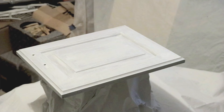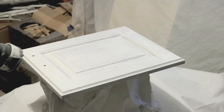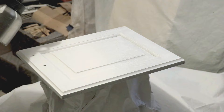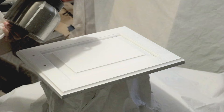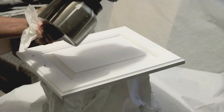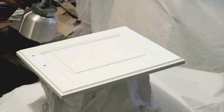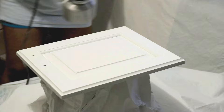Now I'm going to show you how to do it using an actual spray gun. I am using the Titan spray gun, but any spray gun will probably provide the same result. Make sure you are not so close that you put too much product on top of your door — this will allow it to have a factory-like finish. I prefer to have my doors sprayed with a spray gun because there were a lot of streaks in the primer when applied with a brush. Using a spray gun gives you so much product in a flawless way that you typically sometimes only need to do one base coat versus going back with a brush or roller two or three times.